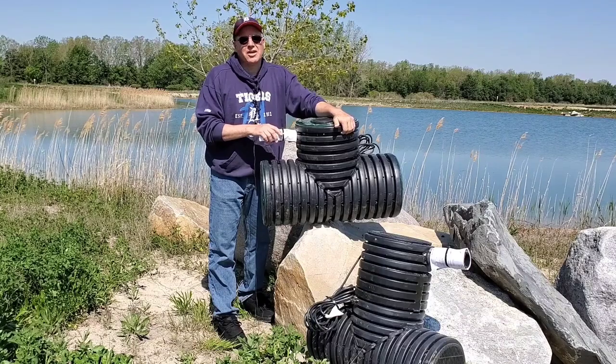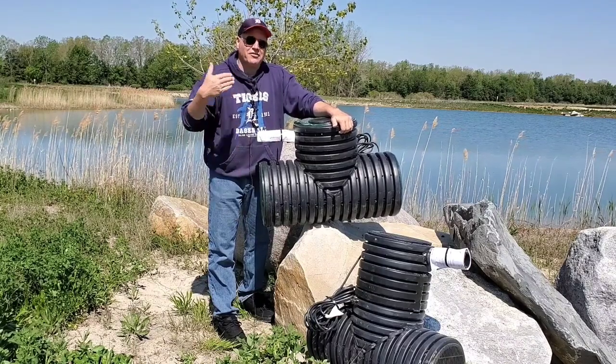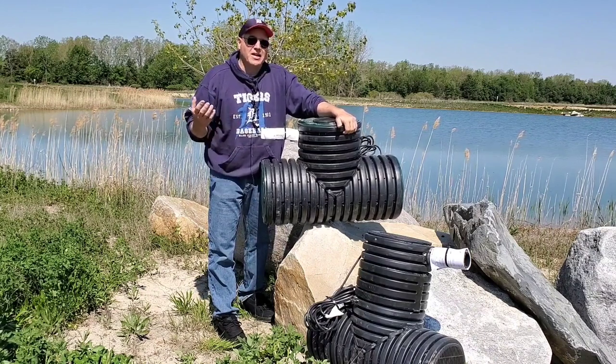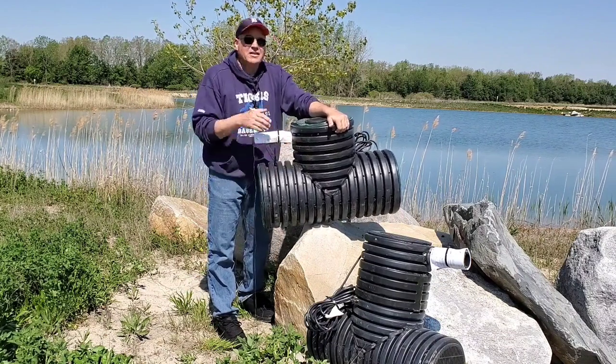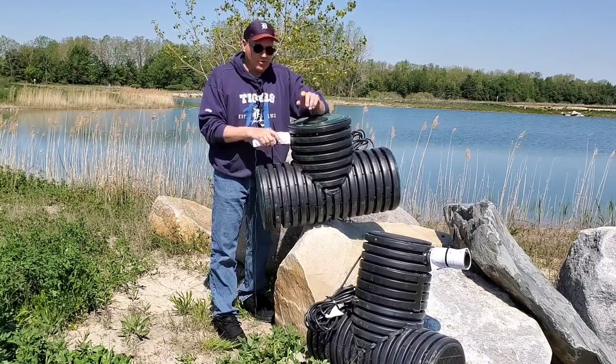It'll shorten a sump pump's life so quick if you have a small basin and you're just repeatedly going on, off, because it only holds like 5 gallons of water, or your check valve goes bad and now it's just going to turn on and off as the water flows back in and then gets sent back out and flows back in until it burns up. So our patented outdoor sump pump system prevents both those.